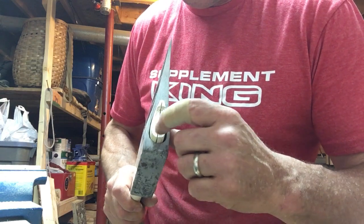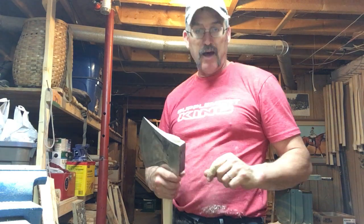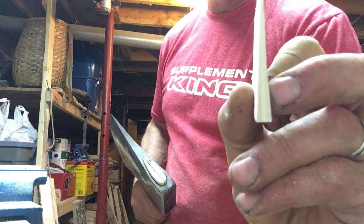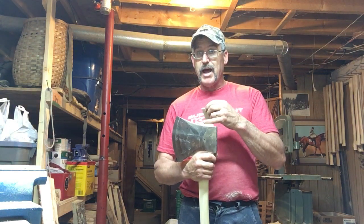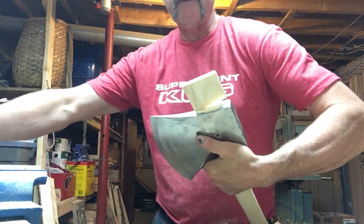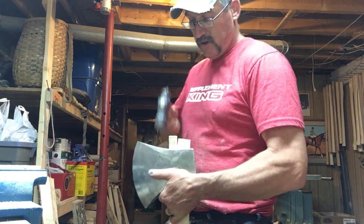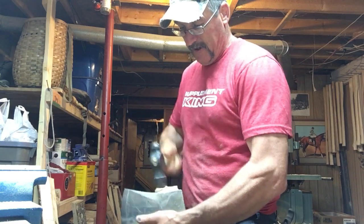I want my wedge down in there about an inch and a half. See how thin the wedges are — this one is about two inches long and nice and narrow, but I've got about three mils at the top. So if I put that in there, by the time it seats it'll be down as far as I want to go to fill up the gap in the middle of the eye. And it's going to give me my three mils at the top to tighten it up. I just set my wedge in like this, gently at first — she's starting to fetch up. I'm just going to pound that along. I'll beat that in there as far as I can. That front part's busted off already.